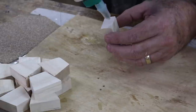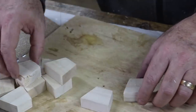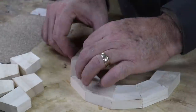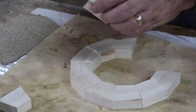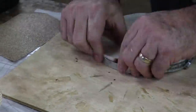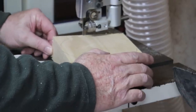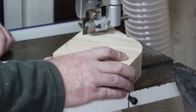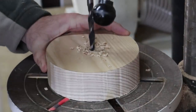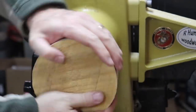I'm just going to show the cutting and glue-up of one ring. This is just a homemade chart that I have — this tells me how long the segments need to be on the long side, and it gives me about a half inch overlap from ring to ring. This is just a piece of — it might be white oak, I'm not really sure to be honest — just something I had laying around. I thought it would make a nice pretty base for this bowl.